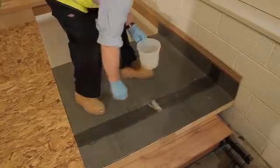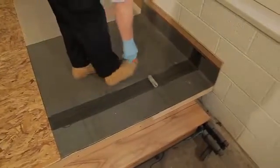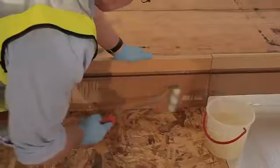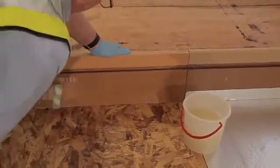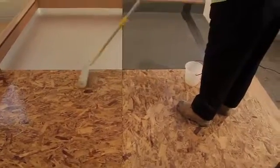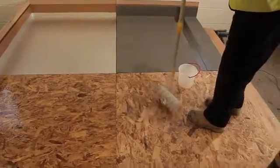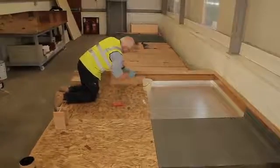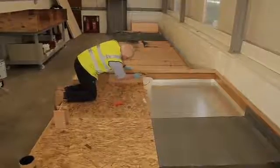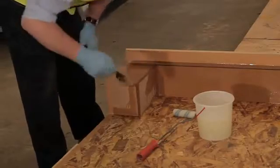As with all liquid systems, apply the details first. Mix the primer and apply this over the lap on the existing felt along its length and also to the plywood surface. The aluminium coating on the insulation and the main area of felt don't need priming. Apply primer at a rate of 0.4 kilograms per metre squared with a brush or roller across the whole surface. Make sure you apply it slightly above the level of the finished roof so you can check that the primer is applied once the roof is complete, but don't apply it too thickly or it may crack when dry.